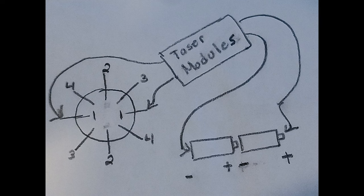I use resistors because they're easily soldered and they stand up to high heat. When you do this project, it's important that those two factors are taken into play, and resistors work really well for that. Just cut the ends off and go ahead and glue them onto your board. On this one, I put number one on the inside and the rest of the numbers on the outside. We're just connecting them 180 degrees out from each other — straight across — so each module goes in the exact same way: one to one, two to two, three to three, four to four. Then we just hook up two double-A batteries.